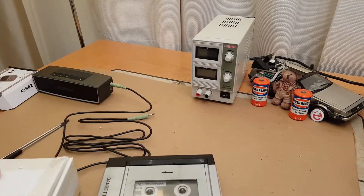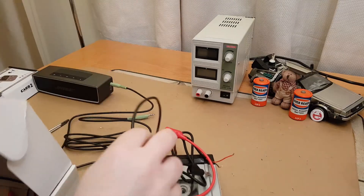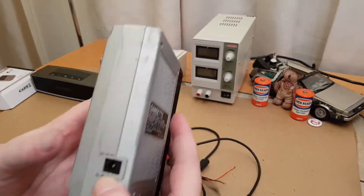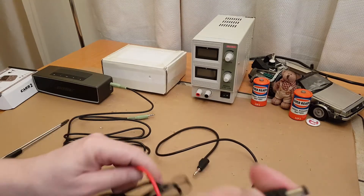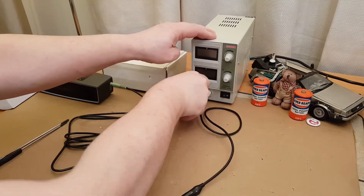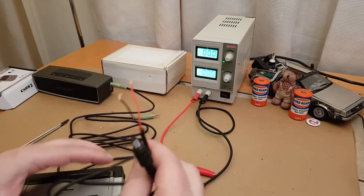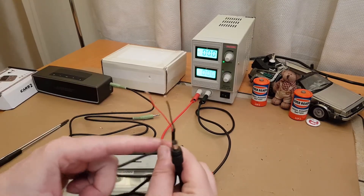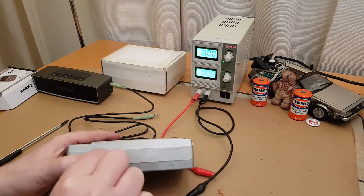For the power supply we have our power lead. On this you'll notice it's DC in, six volt, and it's negative tip. The red wire is the center pin and the black is the outside, because this was from another power supply. I thought I'd just cut that off and use it for this, so that goes in there.